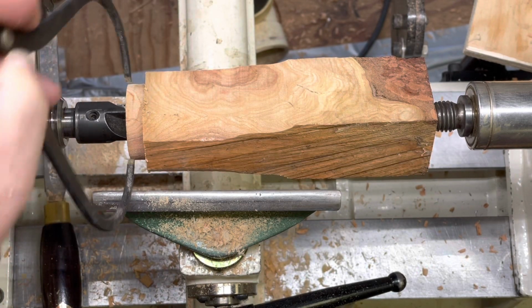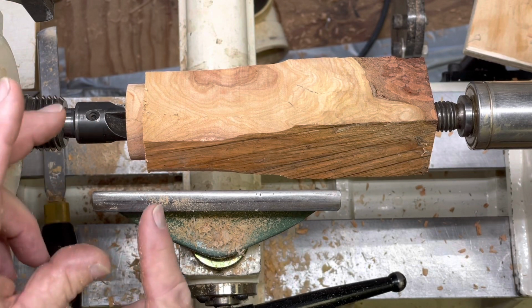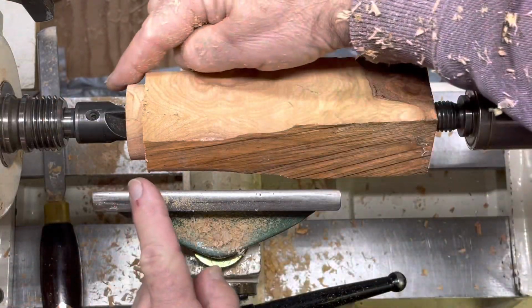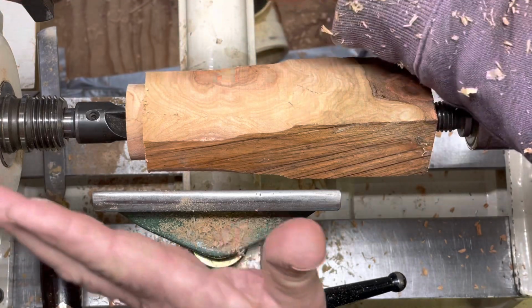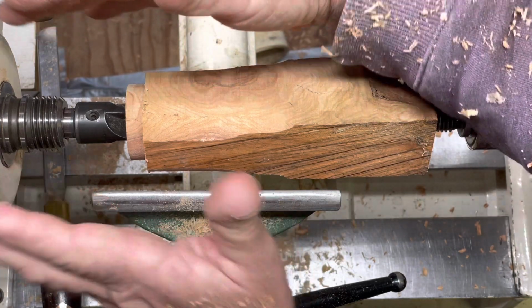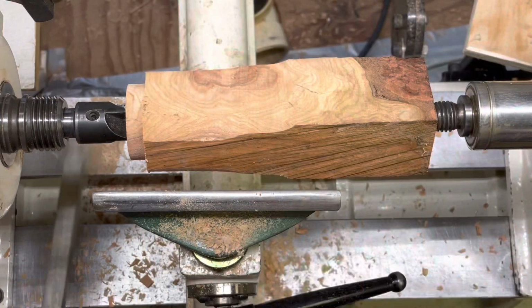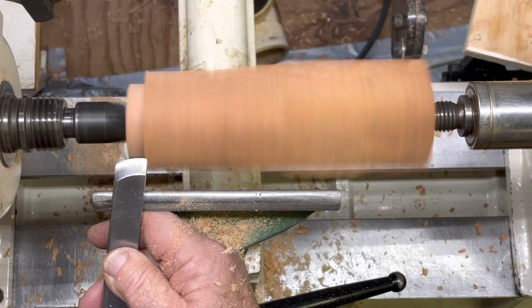And we are. I can go just a little more, or I could just finesse it, because again, with these one-way jaws, these sides have to be parallel. You don't want any kind of taper. And generally, I think always, you never want a taper going this way. If you are going to taper at all, it's this way. But again, I would just take your time and go for that parallel side.